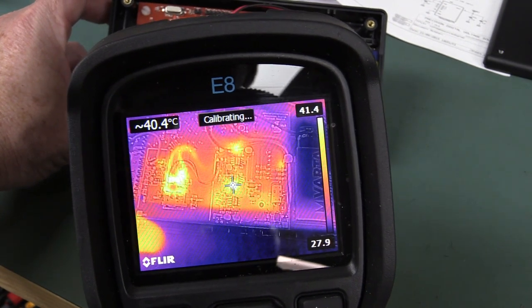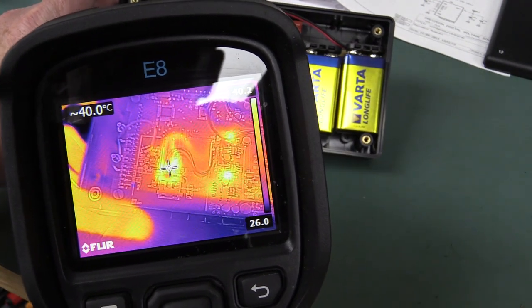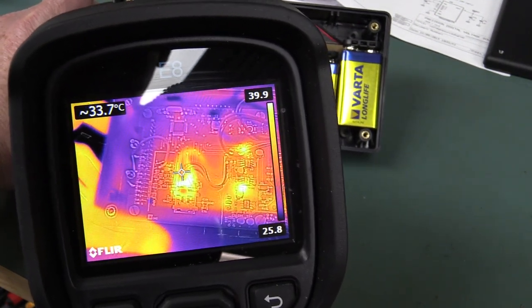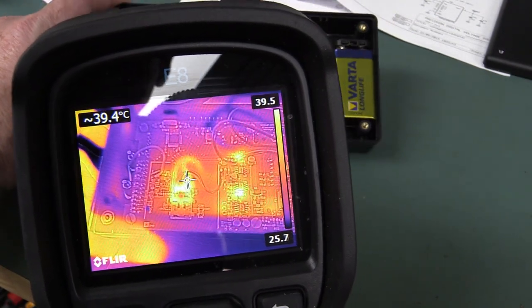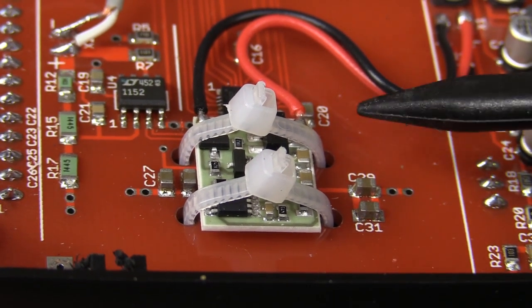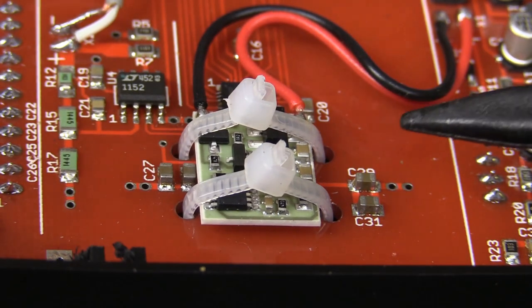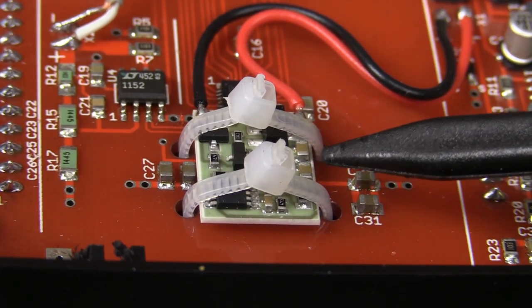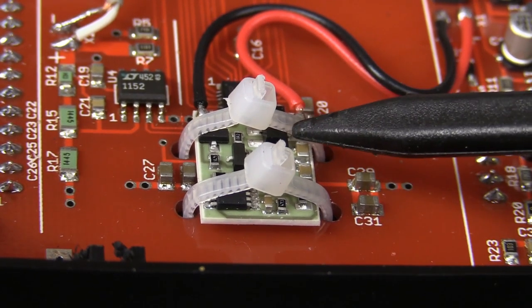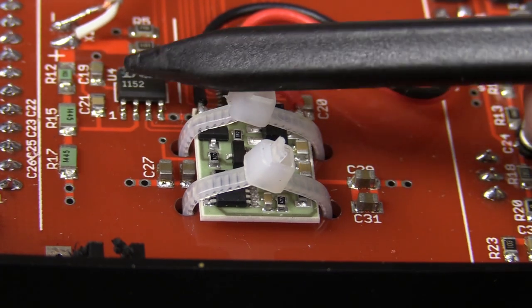Of course, you can see the DC to DC. Is it a DC to DC? No, it's a linear reg. It wouldn't have a DC to DC converter in there. I think it's a linear reg because, you know, with 2 9-volt batteries you don't need it. You're typically going to operate this linear. You don't want any switching stuff in there like that. But that's a little heater board. Actually, I suspect that might be rather clever. What I think's going on here, this is a pure guess, because I don't think I have the schematic for the heater. Anyway, what's going on under there is the voltage reference, which is the Max 6350, in an SO8 or some surface mount package, mounted on the top of this red board under there, just like the others are mounted here.